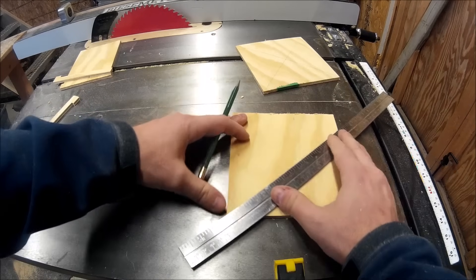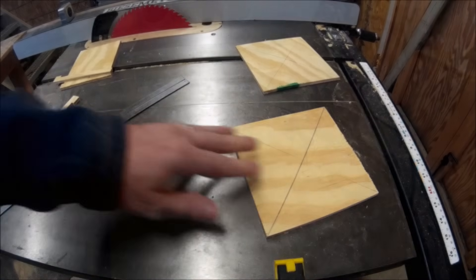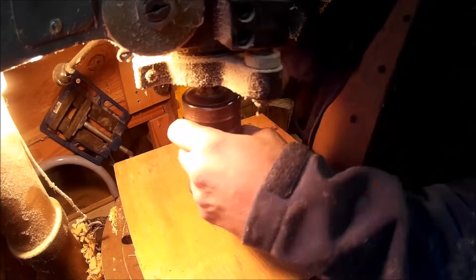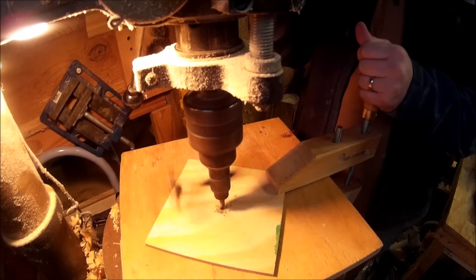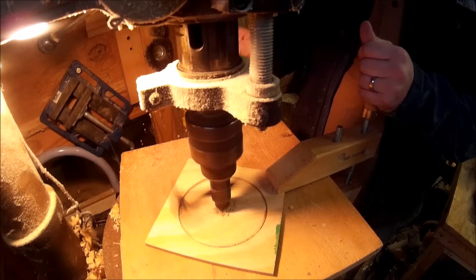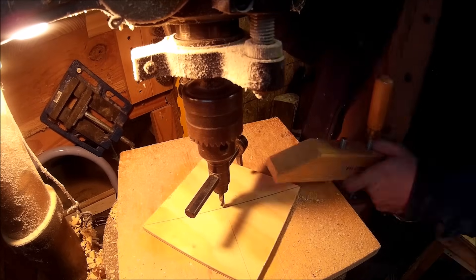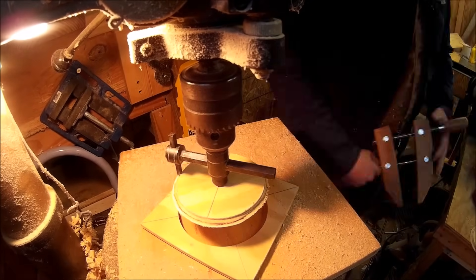In order to start, I had to find the center of the outer pieces so I could put the four inch hole in each one of them, and then I spent some time preparing my hole cutter, making sure I got that diameter exactly correct. I also noticed there was no way to hold it down with my hands, so I used my non-marring wooden clamp to hold that piece down so I didn't get my fingers smacked. This hole cutter is pretty dangerous because it has overhanging pieces that can easily grab you.